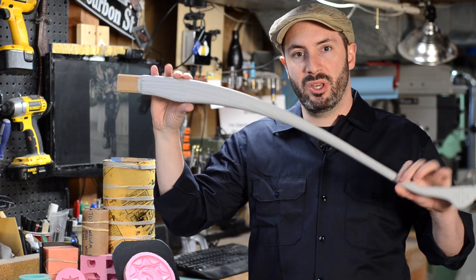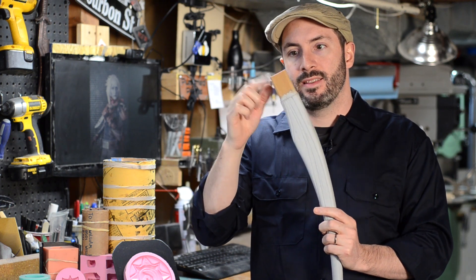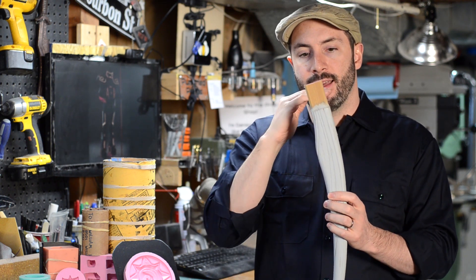For example, this is the piece that I wanted to mold here. I added an extra bit of wood on the end — this is the pouring spout. That'll fill up with resin and allow bubbles to escape, and then this part gets trimmed off of every cast piece once it gets pulled out of the mold. A little planning goes a long way here.